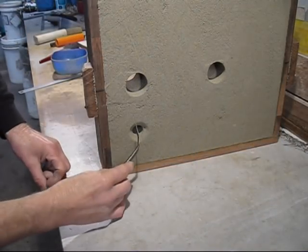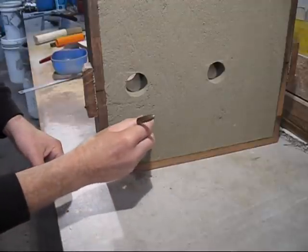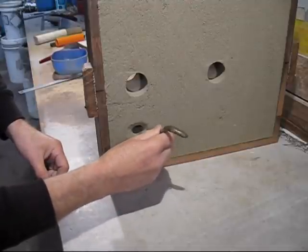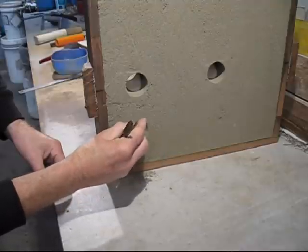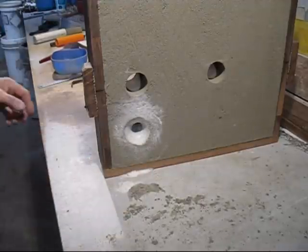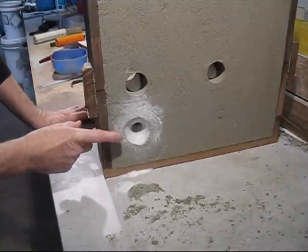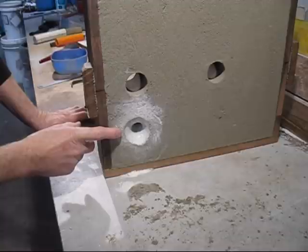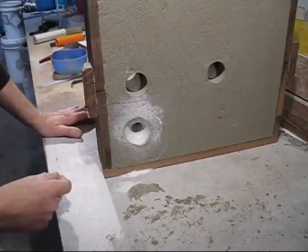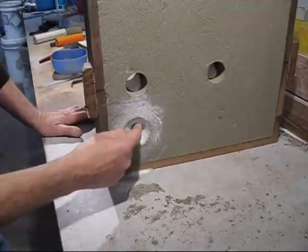Last thing to do, got to put a little pouring basin in on here. Need a bit of a target area when I'm pouring with a full crucible. With the trolley, it can be very difficult to aim. As I'm using my pouring trolley, the crucible will be very full. So it's impossible to get the lip really close to where I'm pouring. So what the idea is, I'll put a lot of parting powder on there and pack it in with your finger like that, and that hopefully stops a lot of the erosion when the first metal hits the sand and knocks off pieces. You don't want that happening.